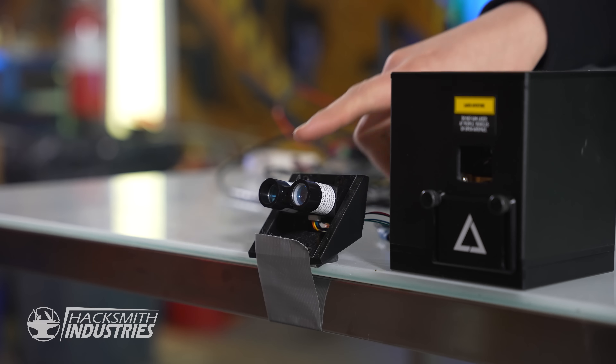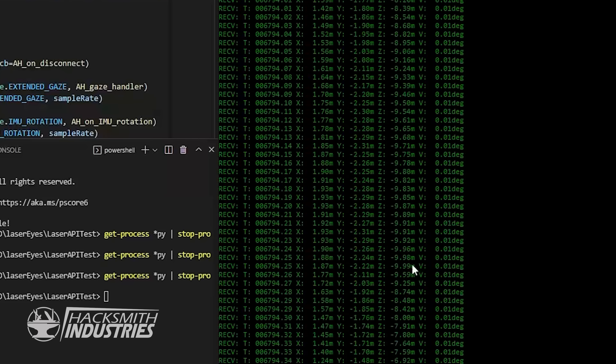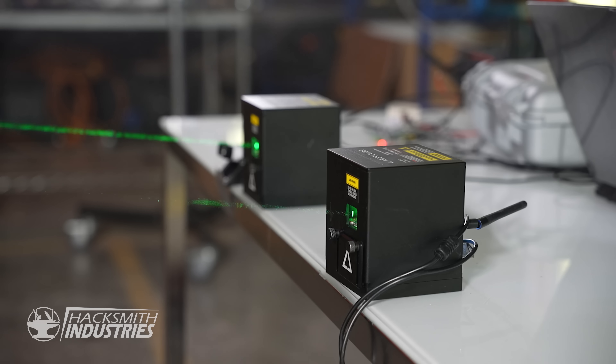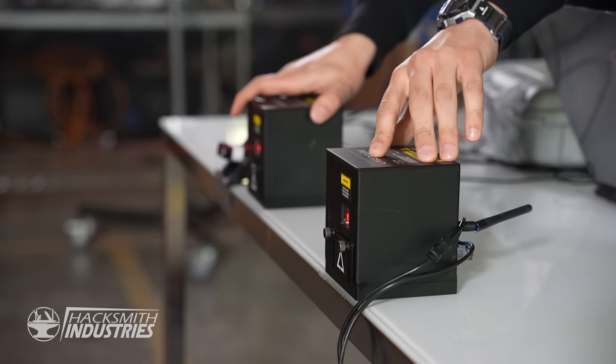I have this laser rangefinder that we're going to add to the shoulder of the thing — that will give us the offset of how far away the wall is. So once we have that, we can take in the eye tracker data and 30,000 times a second for each one of these lasers, feed out a color and an X and Y position for where to put the mirrors, which is going to match what your eyes are looking at. I actually added a calibration that you can step through in the program.